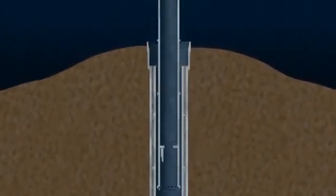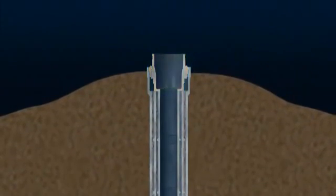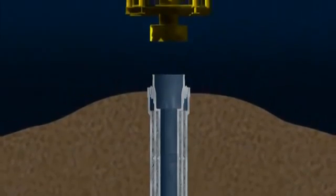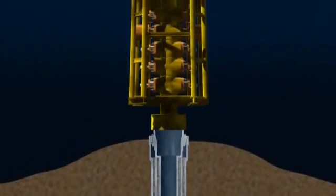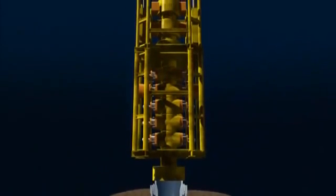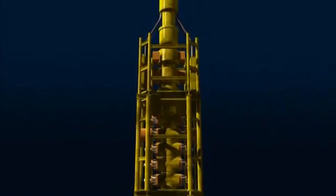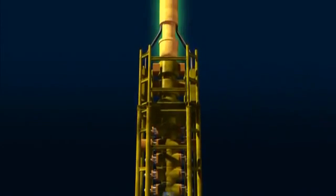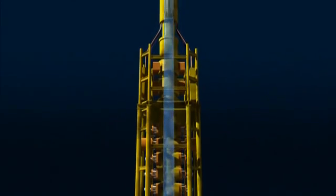This first casing run has an attached wellhead. A blowout preventer, BOP, a robust set of valves that can shut in the well even if the drill string is down the hole, is then lowered and locked onto the wellhead. The BOP is connected to the sea surface by large diameter tubing, known as a riser, which allows drilling fluids to be returned to the surface.